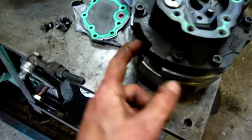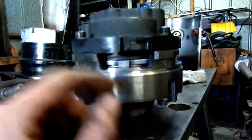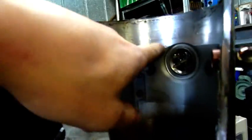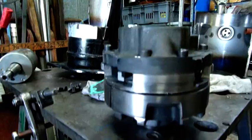Either that or it's partially isolated, because this area here should really be low pressure. So the top part of this casing would be low pressure actually — this side low pressure, and down through the bottom will be high pressure because this is pressed in. These slots and cuts aren't normally there — that's just my grinding work. This pressed-in surface bears against the housing; you can see they've machined a step on it on a lathe. So it makes sense now: high pressure's underneath, low pressure's on top. It's the exact opposite of most other manufacturers I've seen.